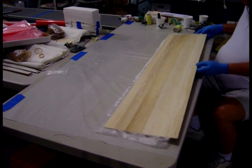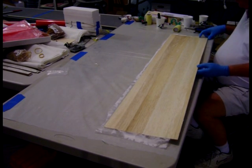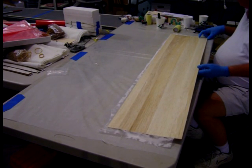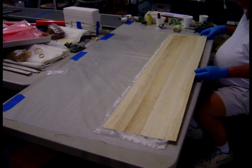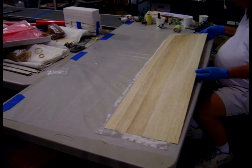I've got the cloth down on this skin. I've got cloth that I'm going to put on the trailing edge, but I'm going to go ahead and do the other skin to this step first before I put the cloth on the trailing edge. The epoxy only has a 20-minute pot life, but the thin film working time is well over two hours.